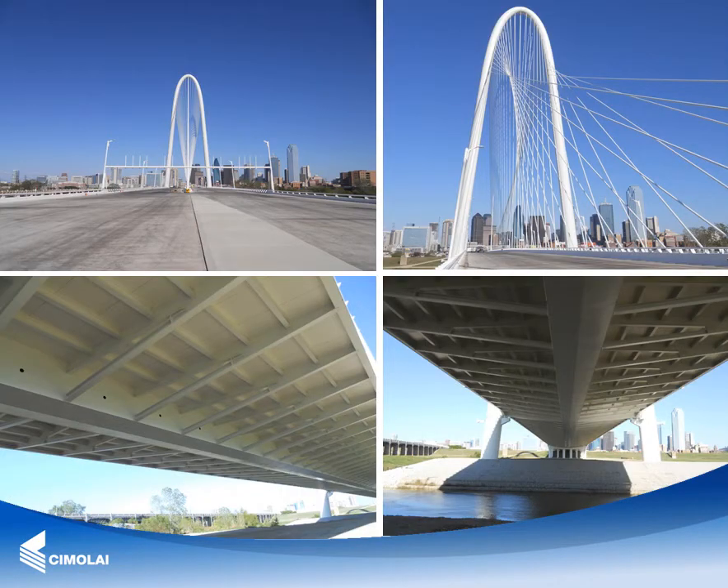The architect's design has been carefully drawn to enable the use of a light, efficient deck system, with a central pylon supporting the deck via cable stays. The array of cables distributes the forces of the pylon, as the symmetry of the permanent loads helps in maintaining a slender and balanced arch.